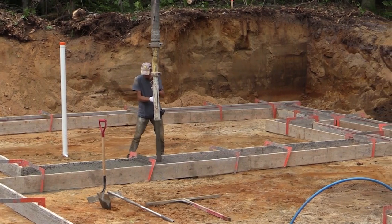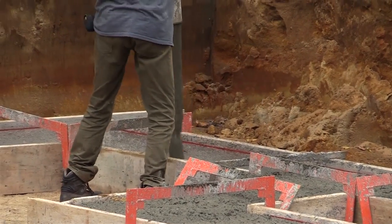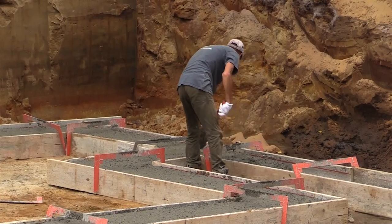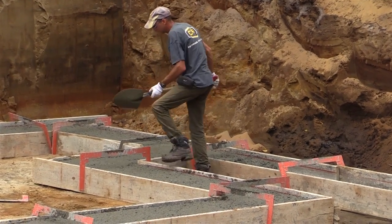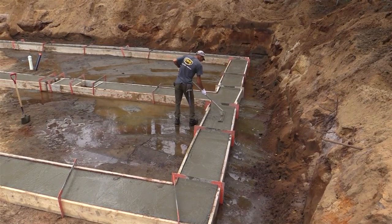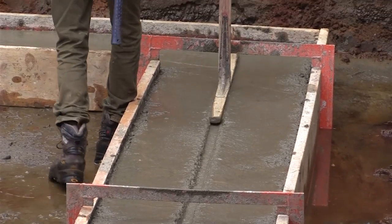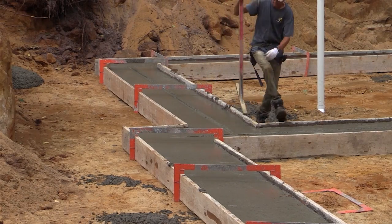You are now ready to pour the cement. During this step, you must ensure that you have the right amount of concrete in order to merge with the line that you have previously traced, which indicates the height to achieve. You can then use a shovel to even everything out. With a trowel, flatten and smooth everything out to obtain a better finish. Then, at the center of the footing, make a deep line of a few centimeters. This line, called the key, will help to link the foundation walls to the footing.